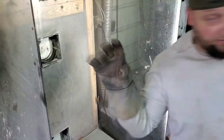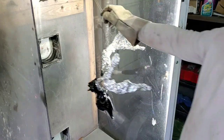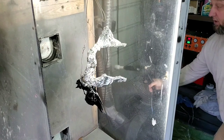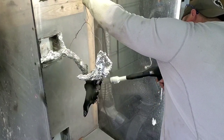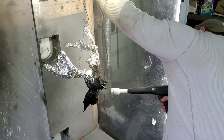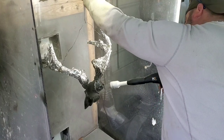Safety first when working with hot stuff. I already sprayed one coat on it, not knowing if it was going to be okay. You can see it in black — it's coming out pretty decent. I'm just going to hot flock this on here, put a lot of powder on it to make it stick, get it up to temp, and spray it in all the holes. She is sticking nice — of course it's only sticking because it's hot.